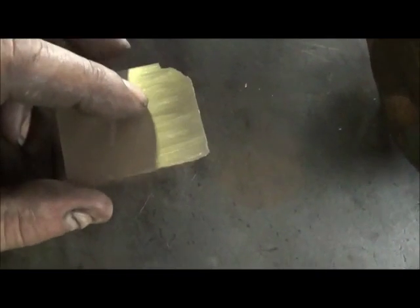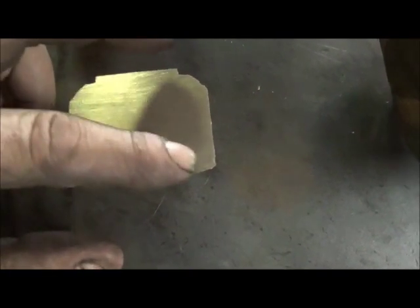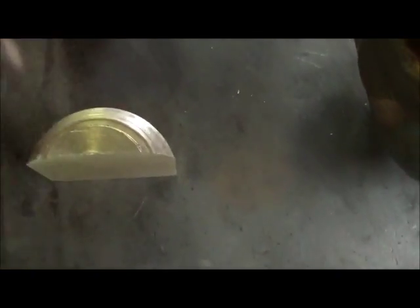We've got it machined off smooth here. What we've got to do now is figure out the chamber inside — that chamber directs the steam or air to go where it needs to go on the valve. You've got to be able to hook a rod to it. Most of them have a cross in it and sometimes a square nut in the center. That leaves the issue of how deep to go with the piece. I wanted to do it on the horizontal mill and round it.